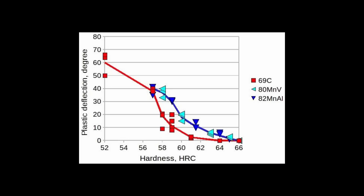One of the things he discovered was that heat treating in a forge is extremely sensitive to temperature if there are no grain pinning elements. He was careful in the 2015 study to not overheat the 1070 steel, labeled 69C, but even so the grain still coarsened somewhat and toughness was worse than the other steels. This shows just how difficult it can be to avoid grain growth with uncontrolled heating in a forge, torch, or similar.